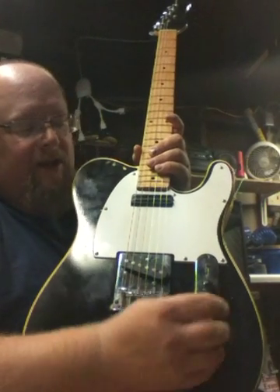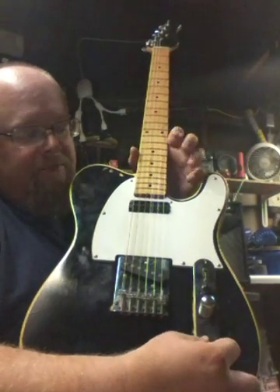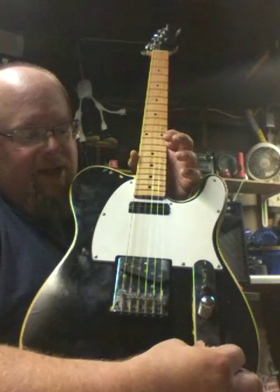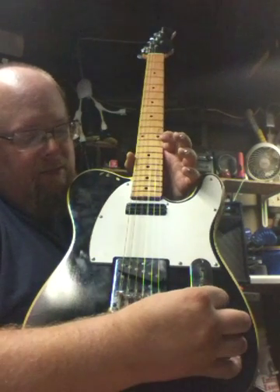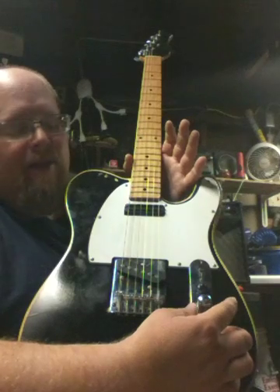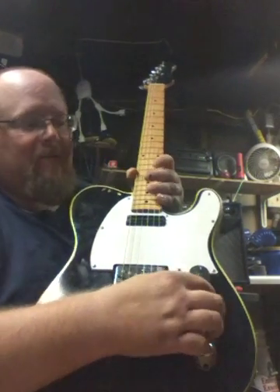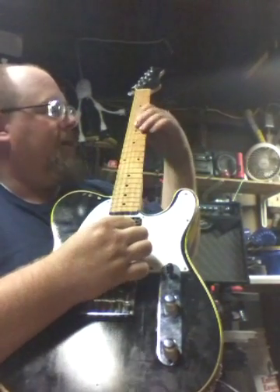With no resistance issues and no problems, there is some feedback. With the tone all the way down, you can hear it — it just kind of muffles the sound and doesn't really change too much. They're not pull-knobs. The volume does work; it took a lot of rewiring to get it correct because whoever wired it before had it hot all the time — no matter if you turned it up or down, it was still on. Multiple wires were originally grounded to the pickup.